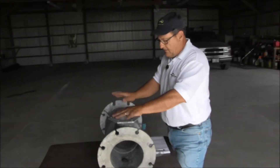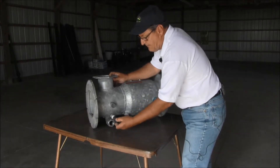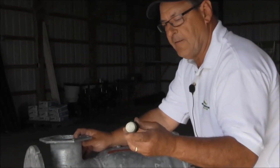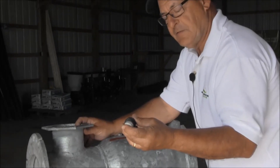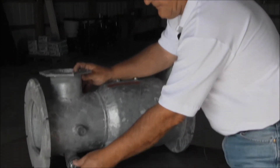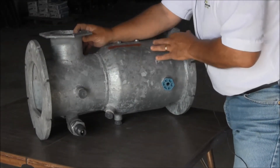If that's working, we're good to go on the flapper valve. Your low pressure device is at the very bottom of the anti-pollution device, and it's a little spring-loaded plunger. When the water pressure is on it, it closes, and as soon as the water pressure quits, it pops open. The spring opens up and then it drains the water that remains in the bottom part of this device, and it does not drain back into the well itself.